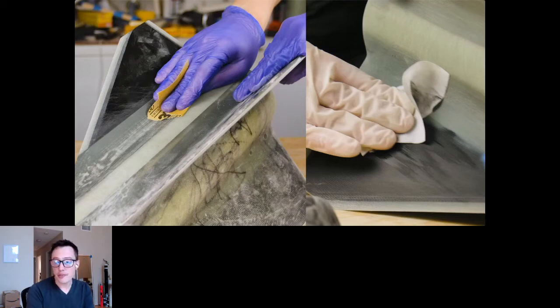Careful heating epoxy — it can give off toxic fumes. The environment I'm in: all of this is done in my garage with the garage door open. In any shot with my face you'll notice I'm wearing a respirator — not just for the particles from sanding fiberglass, but it has organic cartridges in it too. Are you thinking about selling the fillet tool? Not really, but I'd be happy to give you the design file — just email joe@bps.space and I can send you the STL so you can print one yourself.